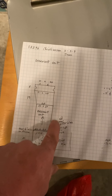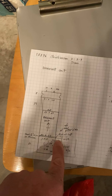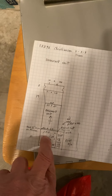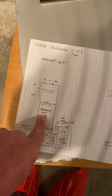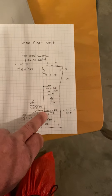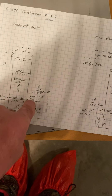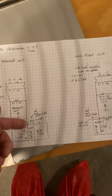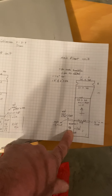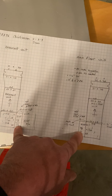These units — you can't come in the side with the return air. So in order to make these work I had to make my base 21 inches tall, then we have the unit transition and a canvas on both of them. I gave you a little angle to put on the front of the filter box. The unit is only 23 inches long and our filter box is 24 and three-quarters, so just put an angle there.